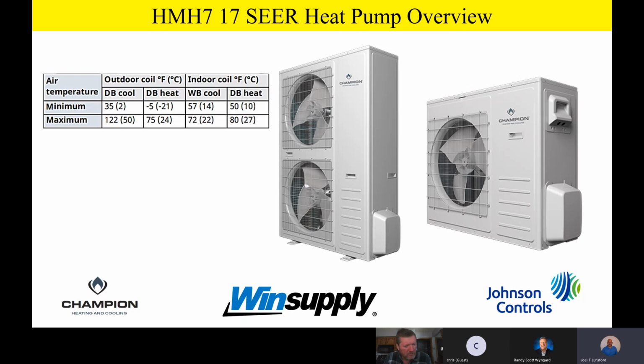So basically, our heat pumps are going to be rated at our standard AHRI rating, which is going to be 47 degrees. There's actually two rating points, 47 degrees and 17 degrees. So at -5, it's going to be at a drastically reduced point.